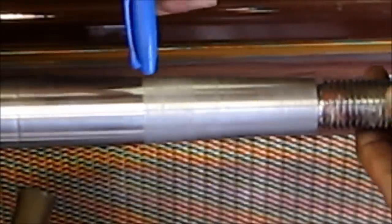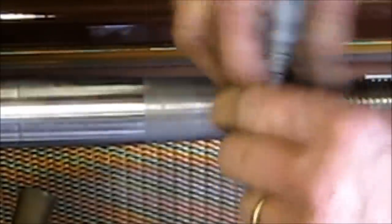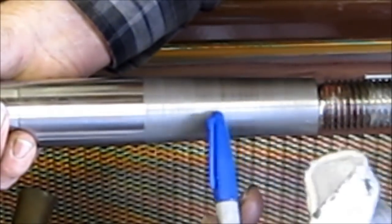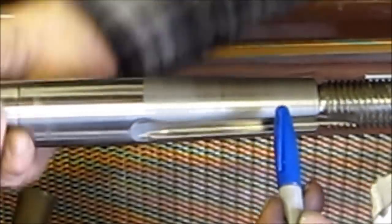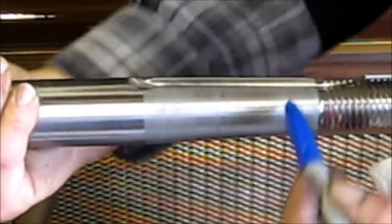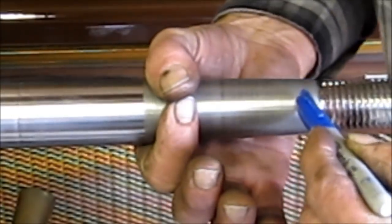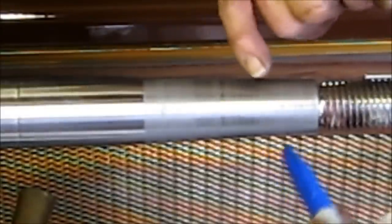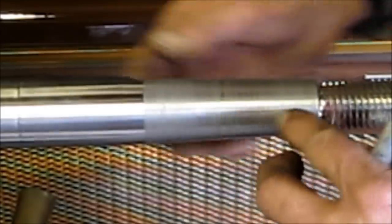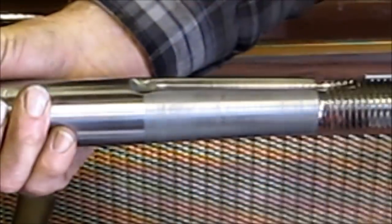The frosty wear areas are where the grit is rolling around and making contact. You have some hollows in here where you're not so great — we knew it was light on this end anyway. There was one point in that propeller that was stuck — one little contact here forced this contact up here, and that's how you got that hollow area all the way in there. By cleaning everything up, we realize that besides this one piece, she was pretty close but she was light in here. So we're going to give her some more wraps and then blue-check it to confirm our analysis.